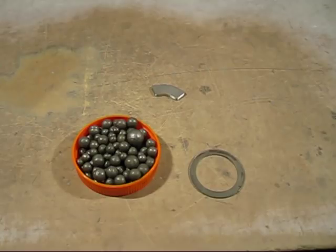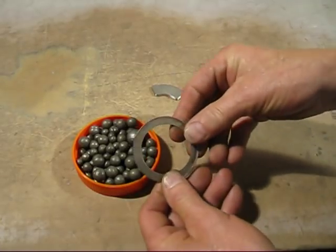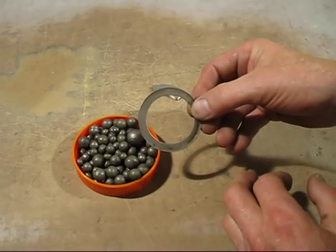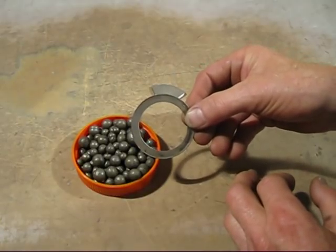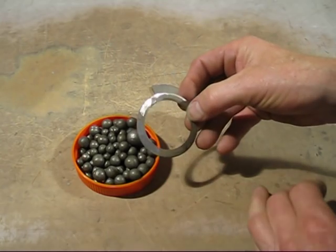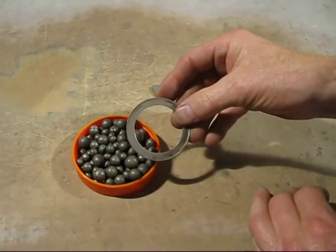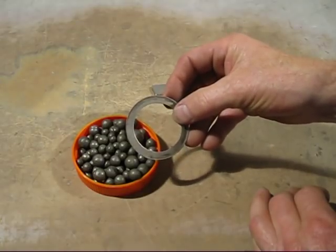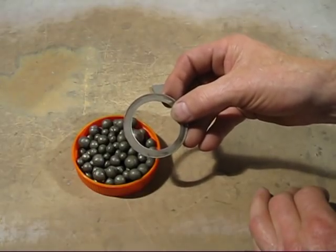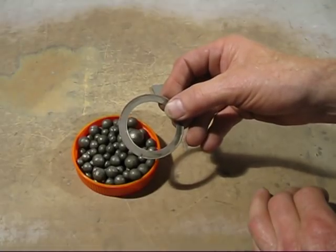Here are two nickel alloys that I know with 100% certainty are nickel alloys. This one is Monel Metal. I used to change these gaskets in a place where I worked — hundreds of them — and I know for certainty that they are nickel alloys. They are Monel Metal, which is 65% to 70% nickel, and the rest is copper and a little bit of iron.